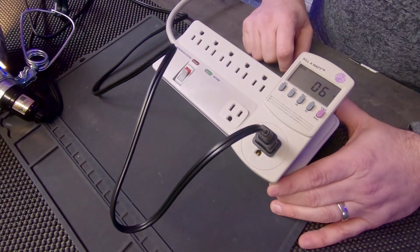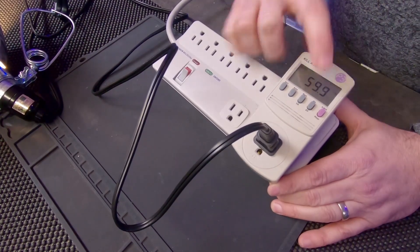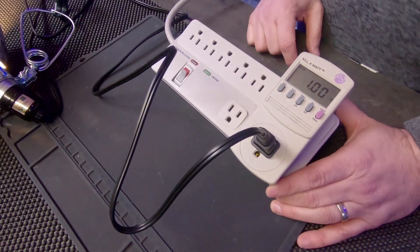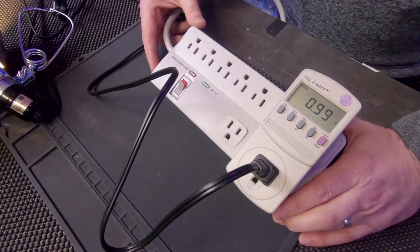If you're into tech stuff and you want to do volt-amps (VA), that's another factor multiplier. If you want to see the power factor — that was actually one interesting thing this has. If you're using computer systems, they're not 100% efficient and their power factor doesn't use the actual phase. So this works out really well for doing single item power monitoring.